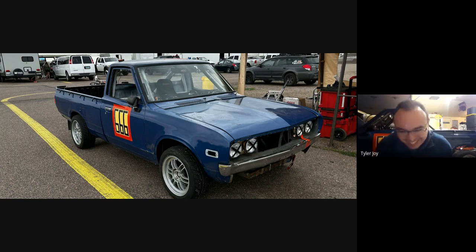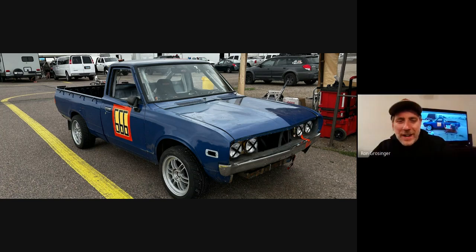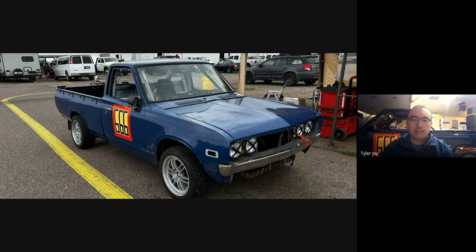Or driving potholes in Colorado. I have a very dumb layman's question. Why even have the back at all? Are there rules about having the sheet metal on there? Can you just take everything off of there? There has to be the crash structure still intact. So like we made modifications, we're going to have to get them approved. There's also rules about how far away the battery has to be from the outside envelope of the vehicle. I think it's 9 inches right now. That's just penetration protection. So if you get hit, and Lemons being Lemons, you're going to get hit, you don't want to puncture the battery.